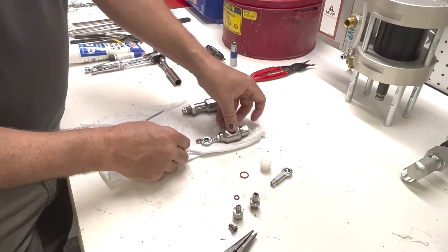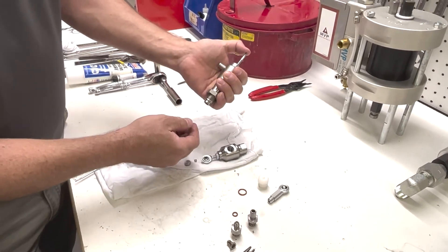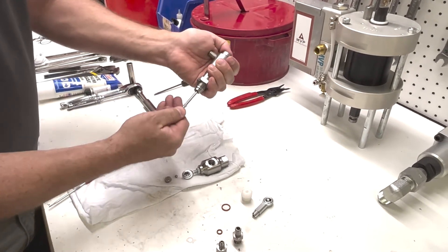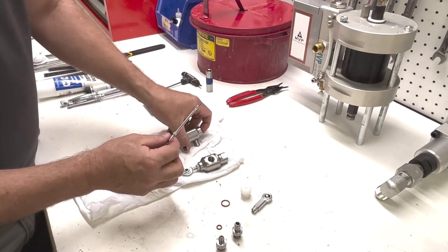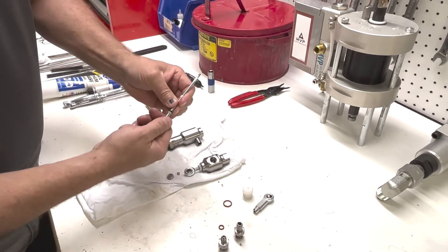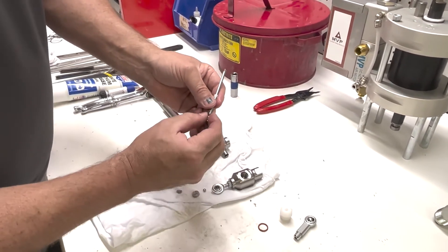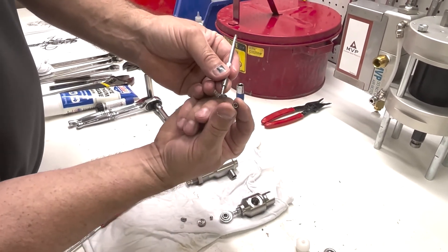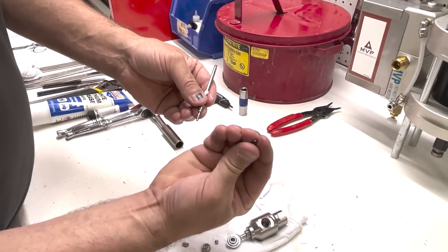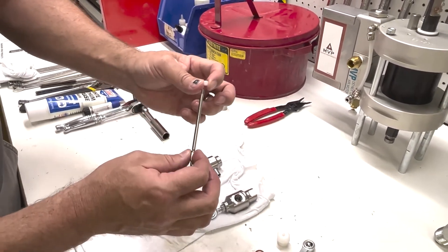At this point we're going to clean everything and inspect it, then we're going to move to the top. We're always going to push the rod through the bottom — never come out the top. It comes out like this. We have our seal, a retainer nut on the bottom, and we have our spacer, then we have our seal. As you can see, the seal has a spring in it — you can see the spring on one side and the other side you can't. When we reassemble I'll show you why. Here's an overstroke spacer; we want to make sure we put this back on here.